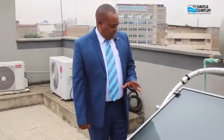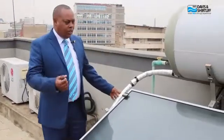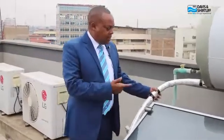On a typical day you can heat the water to up to even 90 degrees — almost boiling temperature. In the solar hot water system, the pipes are lagged to prevent heat loss, so that when you are circulating the water, the pipes are totally insulated and no heat loss occurs within the system.